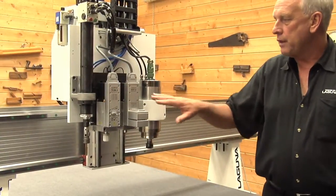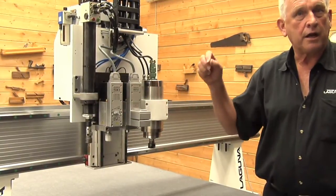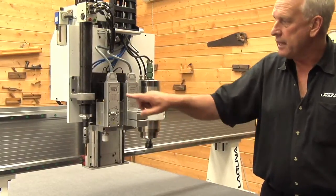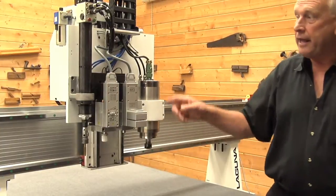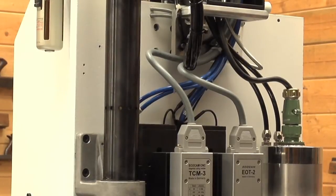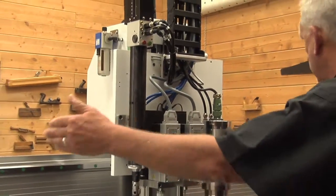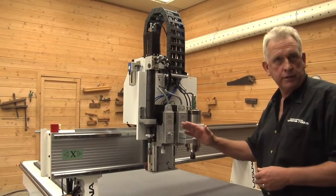Now, 2 of those, we basically put 2 new pieces of technology that we developed. One is an oscillating saw that operates tangentially, which means it has a 4th axis. And we also have a tangential knife that operates with a 4th axis. Now, in this particular case, I've actually put an automatic tapping head on the machine. The wider tool plate is one part of the MT package. Another part of it is an extended gantry, and that's done so that these heads have full table coverage.